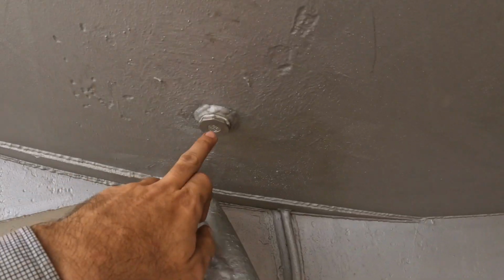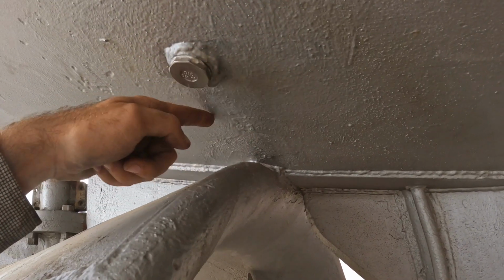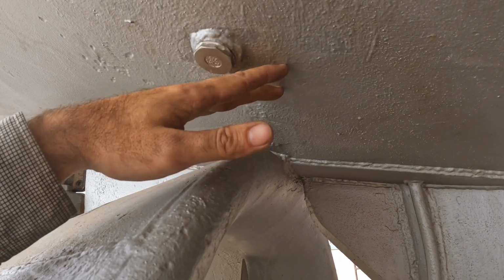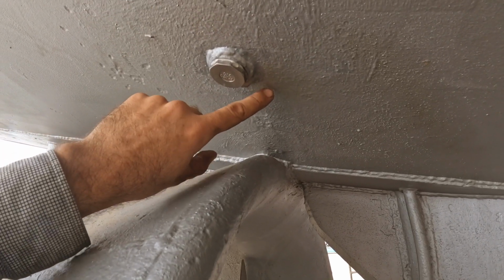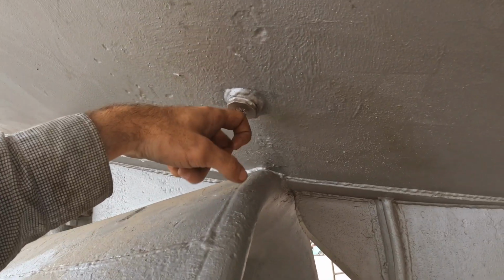Bit of a quick sanity check. So this is the bung that I fitted just before, after we pressure tested everything. If there's any sort of diesel, it'll show up around here, it'll run downwards, you'll get a stain. So it's not going to happen straight away, but we'll give it time. Diesel's a fantastic penetrant, so if you need to leak test and you can't pressure test something, diesel's often a really good way of doing it, because you'll see that stain running down.